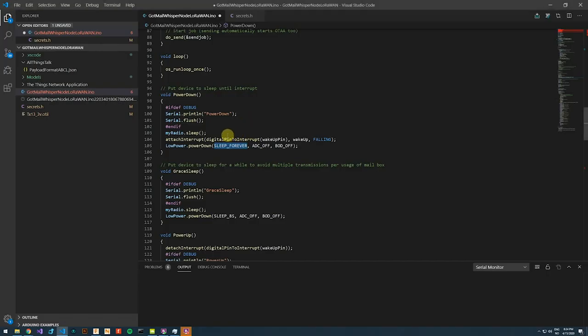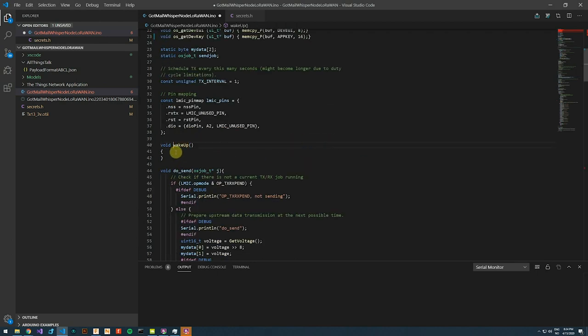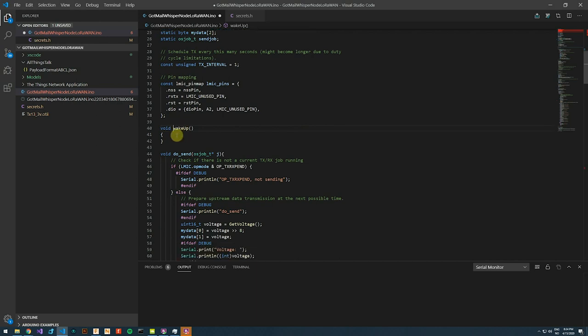So when the lid triggers the switch, this method is called. It does nothing, and it shouldn't do a lot of work. It can set some states or something that you can read later, but it shouldn't hold up the microcontroller, because if you have several interrupts registered, if this is running some long-running code, it will not notice the other interrupts.